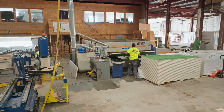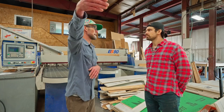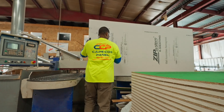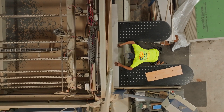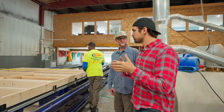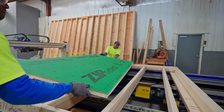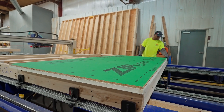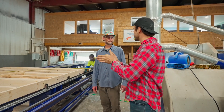This is the beam saw — all the sheathing comes in and they work in reverse: the sheet on top will be the first wall on the line, and by the time they reach the bottom of the stack, it goes on top. The sheets come up and go into the beam saw, which has a mouth that shuts with a saw running along the inside. As walls come down the line to this station, they get squared. The guys measure diagonals to get the walls close, and then the pre-cut sheathing — which is perfectly square — squares up the wall completely, like using the back of a cabinet to square the box.